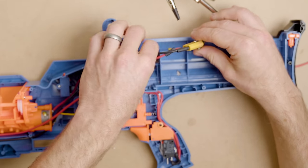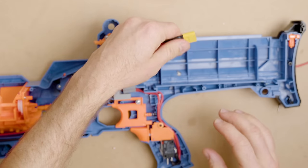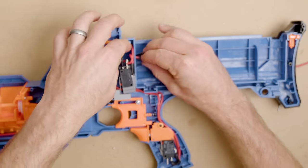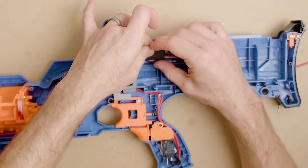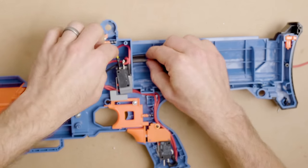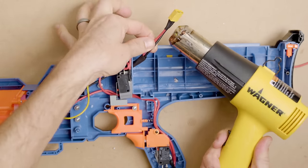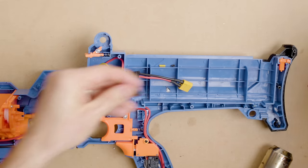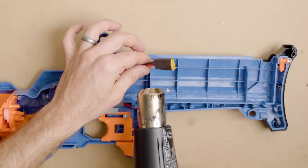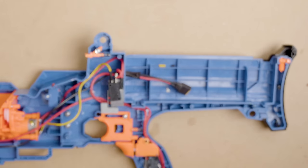While that cools, shove the small pieces of heat shrink on it. Heat shrink is extremely necessary here because that's an easy joint to potentially short. Take this extra piece, fold it, and slide it halfway straddling the hole. Finally, I like to take a piece of half-inch heat shrink, stretch it a little bit, and just plop it onto the XT60 — it adds a little extra strain relief and a nice clean finished look.